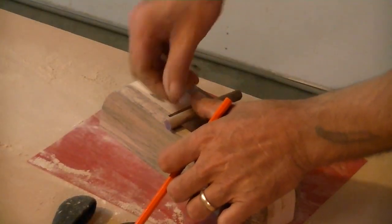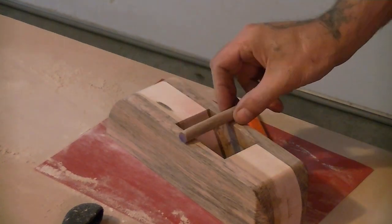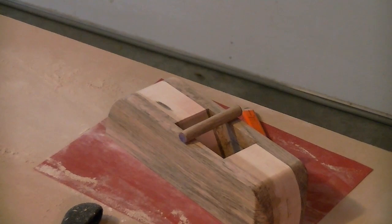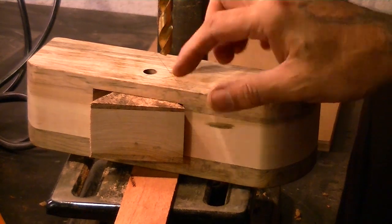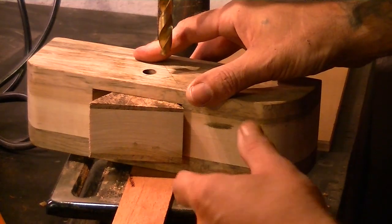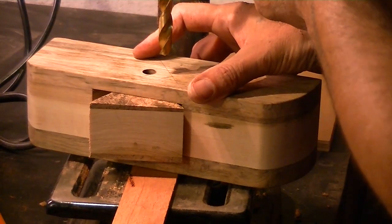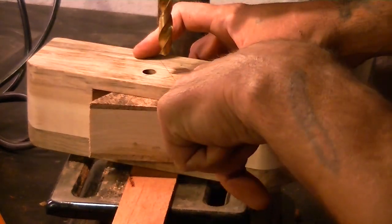I'm going to put a mark here where to cut it. Now I have to figure out what size this is and drill my hole exactly 90 degrees — so it will be a perfect job for my drill press. I just finished drilling my hole, but I wanted to mention: do not forget the leftover piece you cut out from your throat — insert it in there before you drill, and put a piece of hardwood underneath the plane because it's a really big bit, like 10 millimeter, and you don't want to blow out your walls. There's no blowout, and that's what you need to do.